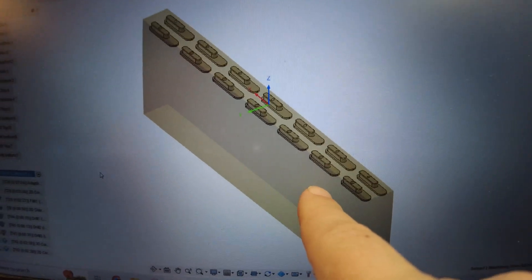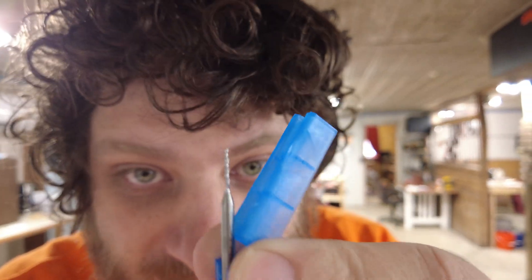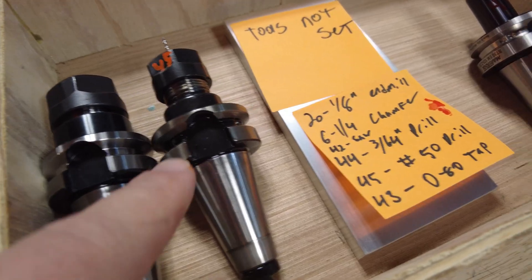I should be able to get about 160 out of a six-inch long piece of material. One of the things that makes these parts scary is they need tiny tiny threaded holes. This is the tap I'm using, and this is the drill bit that'll make the holes that get tapped. These are the screws going in those tapped holes — in this little bag right here there are 50 screws, so that's how small we're talking. Here's a bummer: I assumed that little tiny tap had either an eighth-inch or three-sixteenths-inch shank, both of which I have tons of collets for. Turns out it fits somewhere in between those two sizes and I don't have a single collet that'll work, so I'm going to move on to another project and wait a couple days for the collets to come in.